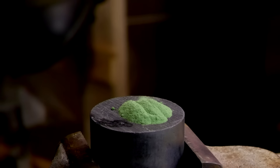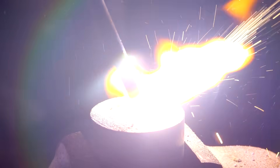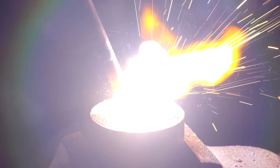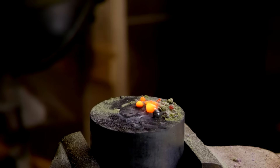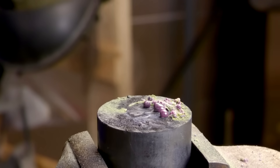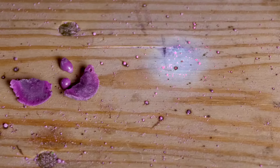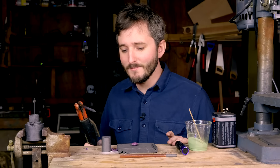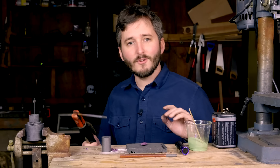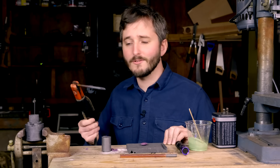My first test was to take the combined aluminum and chromium oxide powder, put it on a graphite plate, and strike an arc with my arc welder right against the powder, trying to push it around with the arc. This blew a lot of dust into the air, but some of the powder melted together and created tiny little rubies — my first successful result. You can actually see all over my workbench: if I shine a UV light on it, you can see little dots of fluorescence which are ruby that shot off the welding arc and landed like little grains of dust. That is how easy it is to create ruby with this method — my workshop is literally covered in rubies. This is approximately the same method Element Maker used on his channel with his first arc welder attempt.